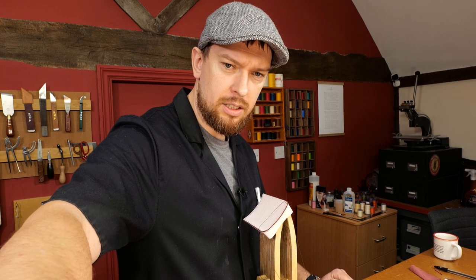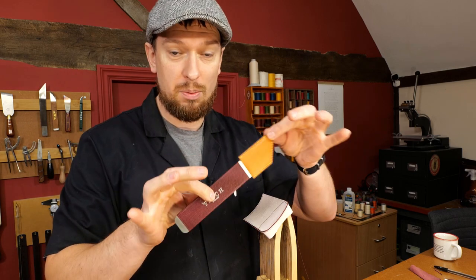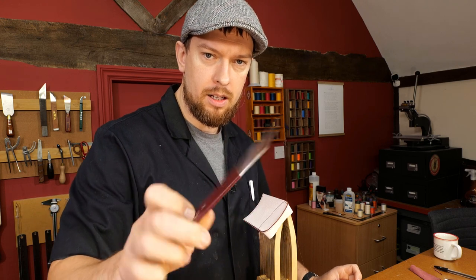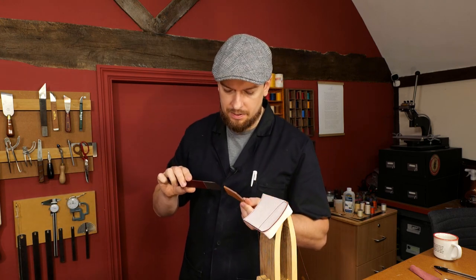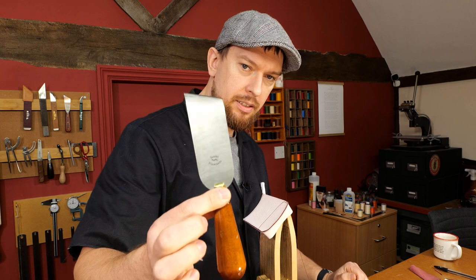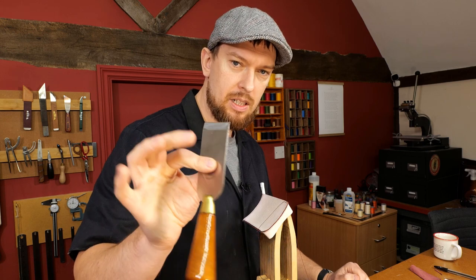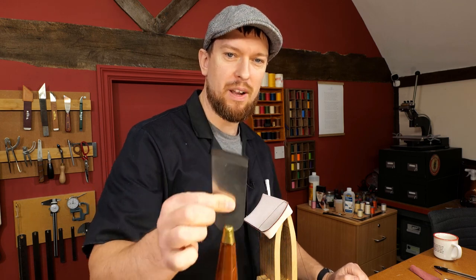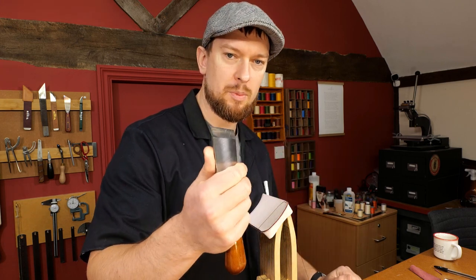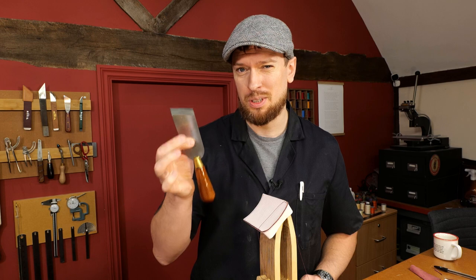With a good quality steel, it will take a 12–13 degree angle. A good example is this one — I made it from high-speed steel, so that's a 13 degree on that one, with a little goat skin wrap. I believe I have the same on my Blanchard skiving knife — also high-speed steel. Really, really good edge on this. This is probably my favorite commercially available skiving knife. I've had quite a few various brands, and this is my favorite. It doesn't come skiving sharp though — it's one of those where you kind of have to know how to sharpen it in order to get the best out of it.